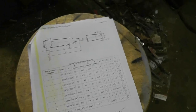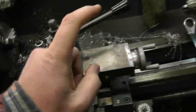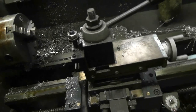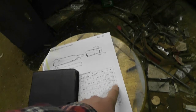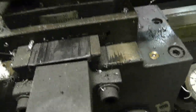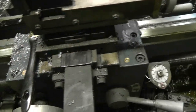There are a couple of techniques I've heard of for generating a taper on the lathe without any real specialty tool. One is obviously you turn the compound at the angle you want and just run the compound along that angle, which is a little hard since the MT2 taper is at 1 degree, 25 minutes, 50 seconds. It's obviously very difficult to set — you can see the measurements there, and one of those divisions is 2.5 degrees, so you can't even set it correctly.